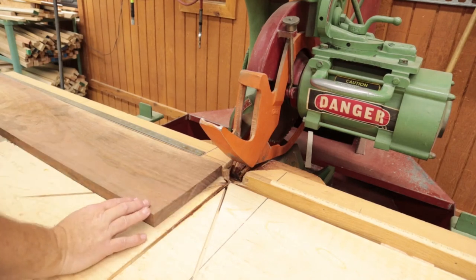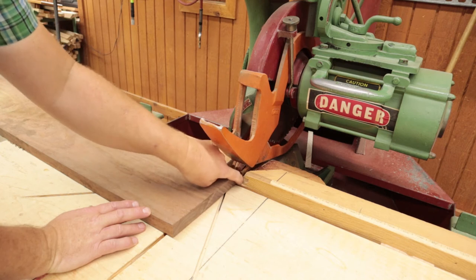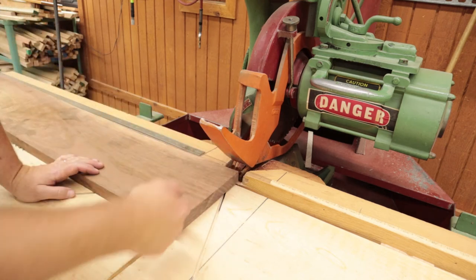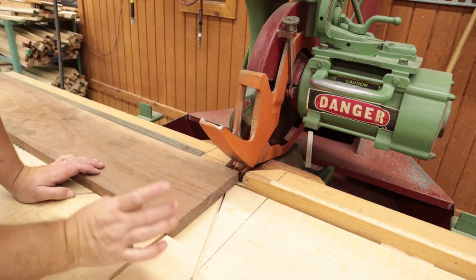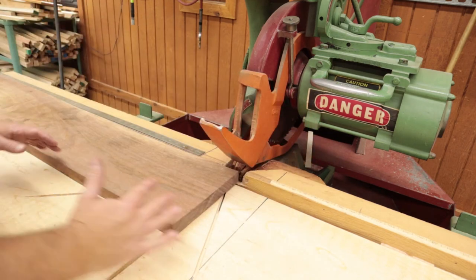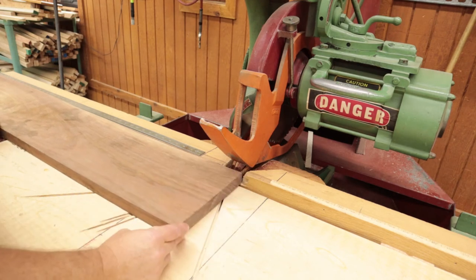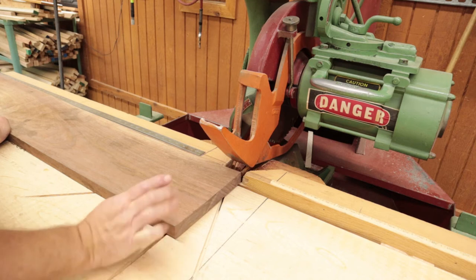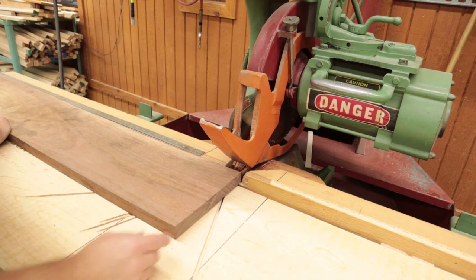When cutting a piece smaller than an inch or two, there's a gap here and sometimes the blade will grab that small piece and throw it back into the dust collection area. Be aware of that. If I'm doing a long piece I like to go at least a couple inches past that gap, but at times we are trimming just an inch or two at a time. If trimming a small piece, know it may get thrown to the back of the machine — nothing to worry about, but be aware of what's happening.